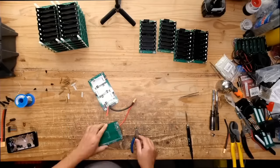And there's a little caveat. This battery here is kind of smart. The way that the Delta turns the battery on, or itself on, is by turning the battery on. The BMS turns its MOSFETs on when you press that little power on and off button. That's what turns the MOSFETs on the BMS on and off. So the battery terminals basically have no power when you turn the unit off. So if I were to tie in a secondary battery in there, then that would make the unit on, right? It's this weird thing.